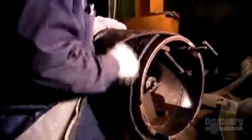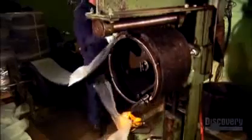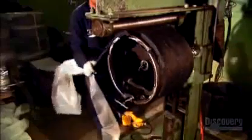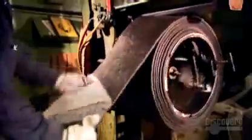Over at another station, they're building another type of solid tire with no metal framework, so it will fit on a wheel rim made for an air-filled tire. They wind rubber strips around a metal hub that serves as a mold, and a bar presses down on the rubber wrap to eliminate air pockets. These rubber strips contain recycled material, which is stiffer, helping the tire hold its shape in the absence of a metal framework.